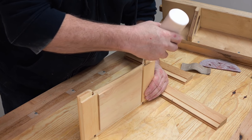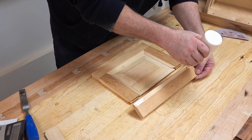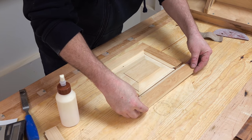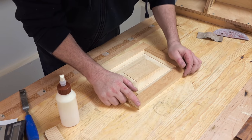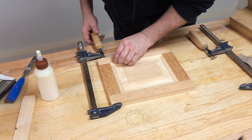The panel really should be finished — with stain if you're using it — before you put this together. In my case I'm not using any stain, just a clear finish. You really only want to get glue on the stiles and rails; you don't want to get any on the panel at all.